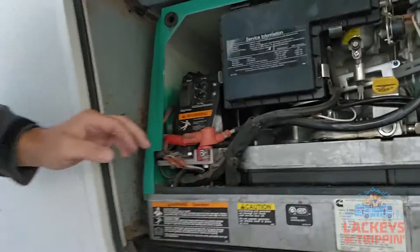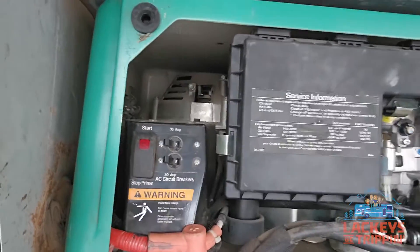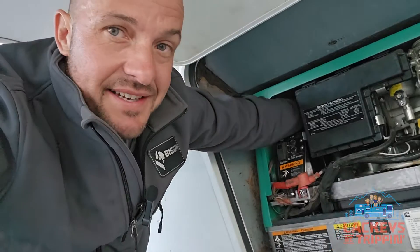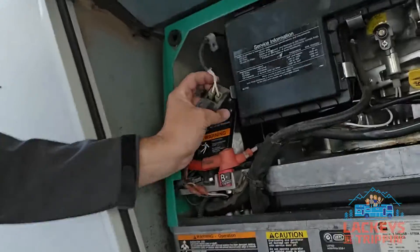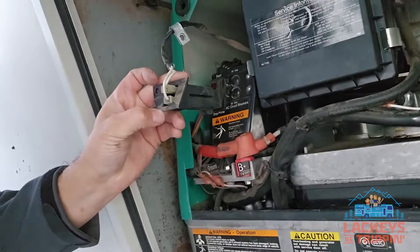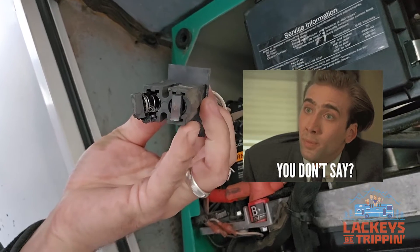The first step in diagnosing this: if you look over the breakers and the start switch, you'll see what looks like a silver beehive back there. There's a 10 millimeter screw going into that beehive. There are a couple of wires, and when you remove that screw you can pull this brush block out from the armature. And this is what you're going to see — obviously one of these is broken. You want them both to look like the good one, not the broken one.